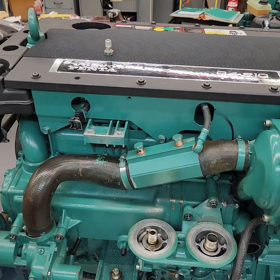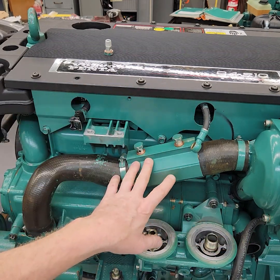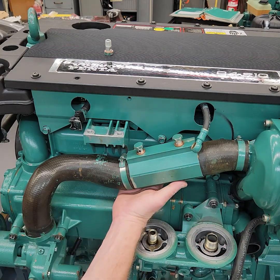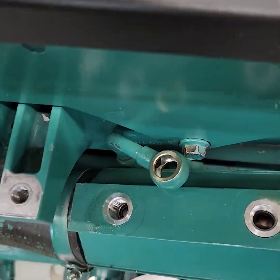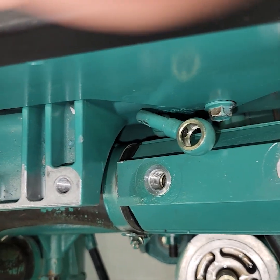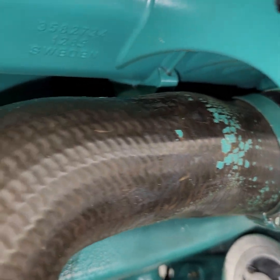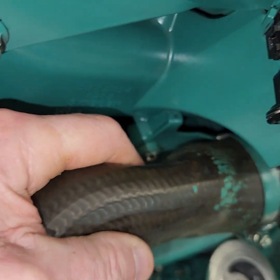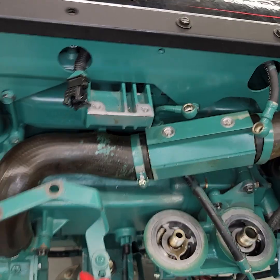These don't drain — they've got check valves in them, so make sure you use all the filters. I've got one fitting out and the other one I've already removed earlier. Now you have two hose clamps — I've already taken this one off. I've got to loosen this one up, and this is where there's a bracket back here. You can see the hose clamp back down in there. It's kind of hard to see, but there's a bracket — it goes around. If I can get this into position, you can see the piece of the bracket right there, and that goes over that slot. That bracket there goes under the hose clamp back in there.